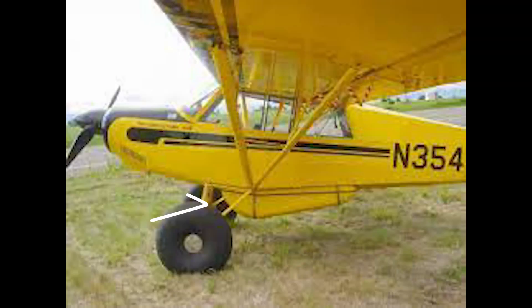We're going to placard it for 300 pounds. For those of you that are going to ask — no, you can't just go buy one of these. I looked around and there are some producers making them for Super Cubs and things like that, and I think you could make one work on a Bearhawk. But in my scenario I was trying to keep it as far forward as possible. I didn't want that abrupt drop that's in the majority of the production ones that basically just come up behind the gear legs. I was trying to eliminate drag by allowing it to come up over the gear legs, close the gear legs, and have a nice smooth taper out of the backside of the cowling and down the backside.